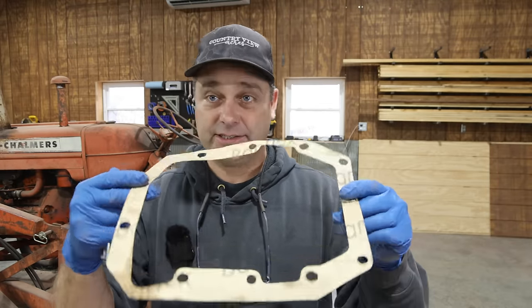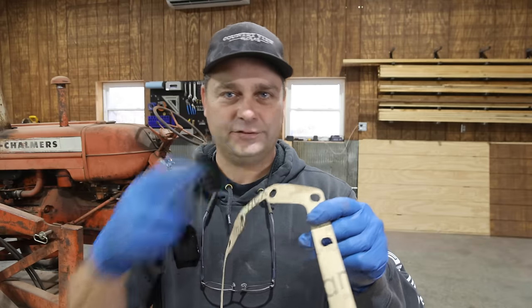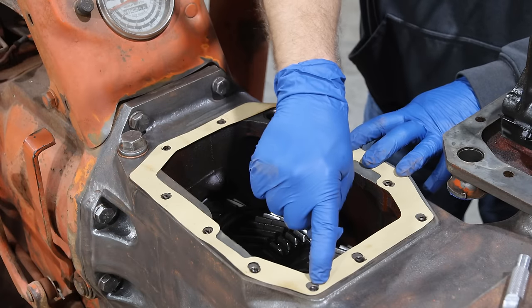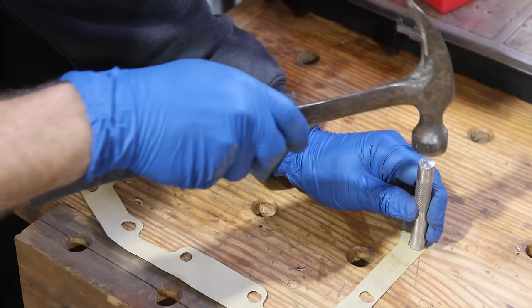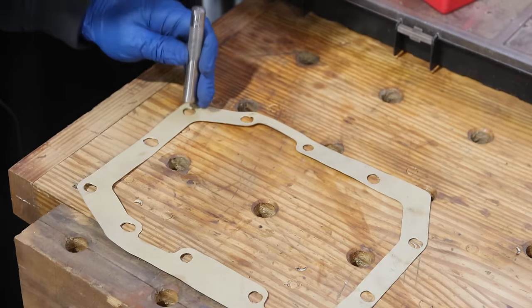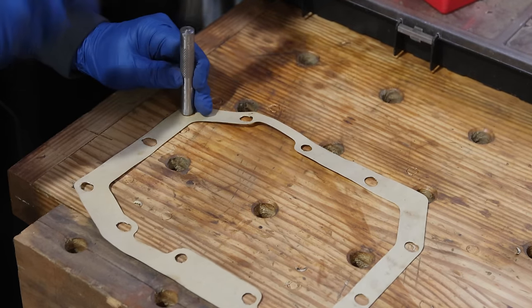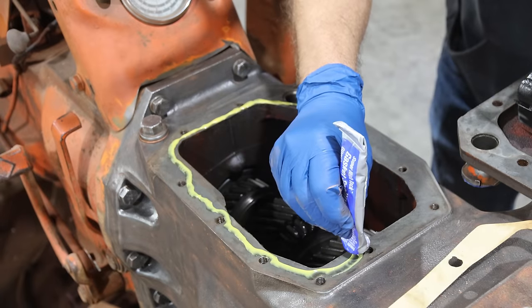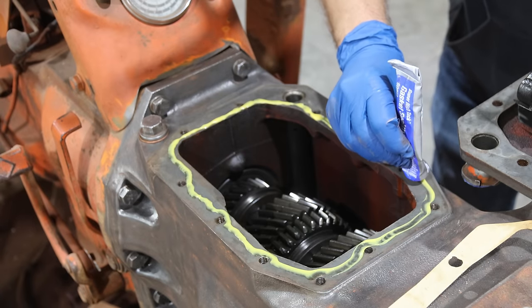So somehow I forgot to hit the record button. What I was using is a hollow chisel or hollow punch - this is just a cheap set I got at Harbor Freight. This is a three-eighths inch hole that it makes. I was able to lay this down onto a piece of wood and just punch the hole off to the side, and the holes are now oblong or oval-shaped. It's all punched out and ready to try. I think I just need to repunch this hole right here and this hole in this corner, and I think we'll be fine.